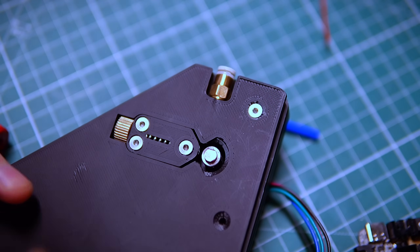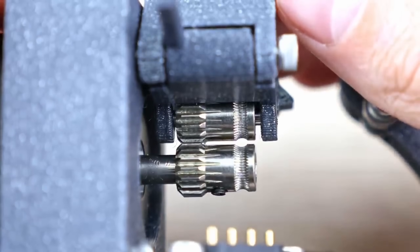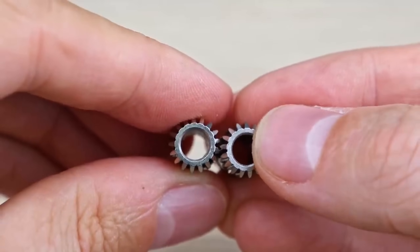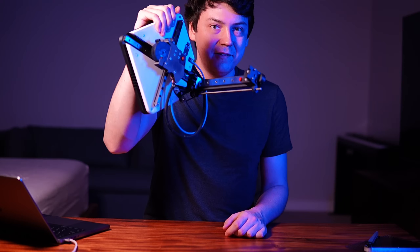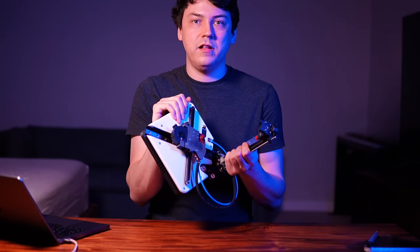Tacking on an extruder onto the mile-long list of things I had to engineer seemed terrible. However, I had overestimated what needed to go into it. I had it modeled and a prototype printed within a day. And not only that, but it could actually be the coolest extruder ever. The biggest hurdle was just getting over the preconceived notion that it had to be a dual drive extruder. I came across a video of a guy who tracked an issue down to his dual drive gears — take them a bit out of alignment and you get uneven backlash, where there's a little gap so they don't rotate perfectly in sync. That freed me to make this single drive version. Just the way all these pieces fit together in a tiny area is a sight to see, and it's a great thing to experience as a designer. I'm proud it feels so solid — not a hack job.